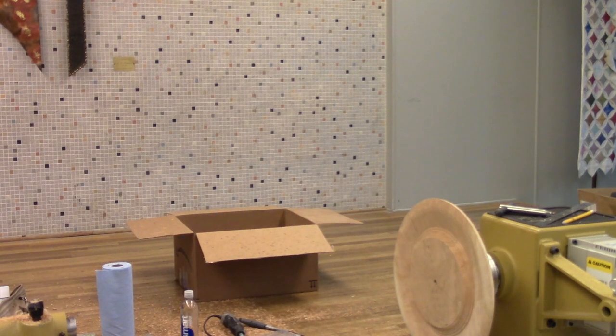What kind of epoxy is that? The one that's promoted by Woodcraft, and what she demos and represents, is called Maker Epoxy. And they purport it to be a slow cure. So it's not a 5-minute job, which gives you time to move this stuff around. Basically, you pour the epoxy in lines, and then you use your heat gun to move it around and blend it. It's an interesting concept. If that interests you, you need to look up Jess Crow out of Crow Creek Designs.